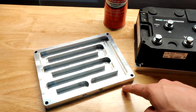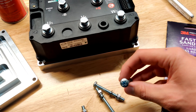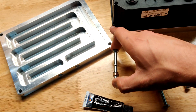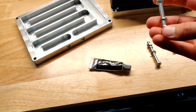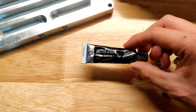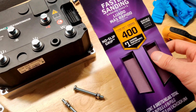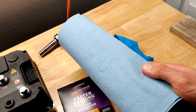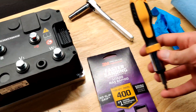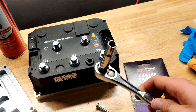What you're going to need is the inverter and chill plate, plus mounting hardware. I used M6 machine screws - make sure they're long enough for both pieces stacked together so you have room to put the nut on. You'll also need sealant or gasket maker - I'm using Permatex Ultra Black Gasket Maker - 400 grit sandpaper, paper towels, brake cleaner, and tools to tighten the hardware. In my case that's a screwdriver and a wrench.